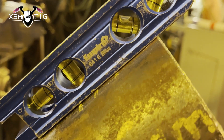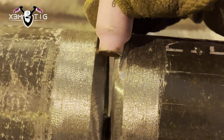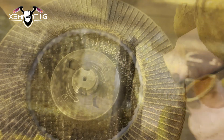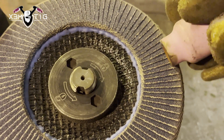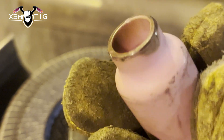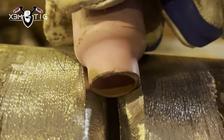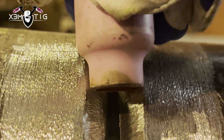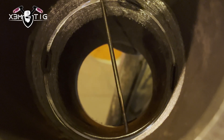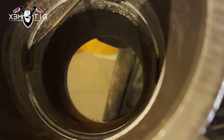This is 6G, 45 degrees. Here's a little tip with the nozzle — there's usually contamination on the edge of the nozzle, making it hard to walk the cup whether you're sliding or freehanding. I like to use a flapper disc on that edge so it's smooth. You can really place a nice, smooth root and it's going to be nice and uniform. If you prefer to walk the cup on the root, that's definitely going to help you. I'm using 1/8" tungsten, 2% lanthanated.